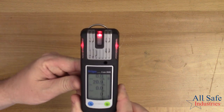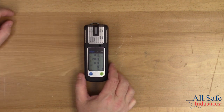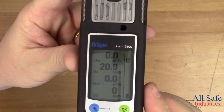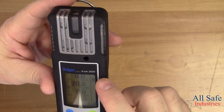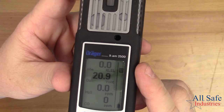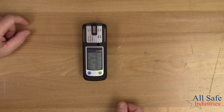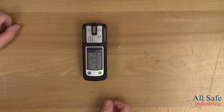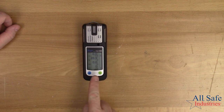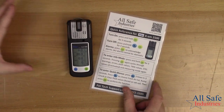It gives you a visual on the lights to show those are working, and you can see the display screen. Draeger has a warm-up icon — when you first turn the unit on you'll immediately get that warning because it takes about four minutes for the LEL sensor to warm up. So anytime you're using the XAM2500, turn it on first to go through the warm-up sequence, then get your other tools and safety gear ready while the meter warms up. Once warmed up, you'll see all four readings shown simultaneously on the screen. We've put together a quick reference card to make it easy to operate the instrument.